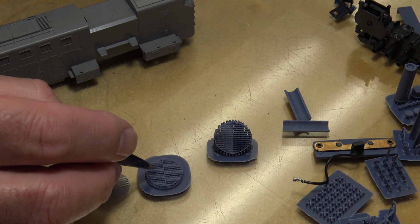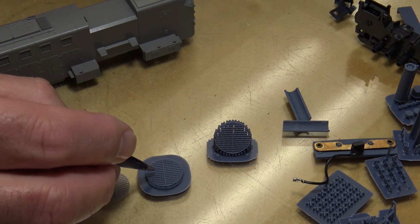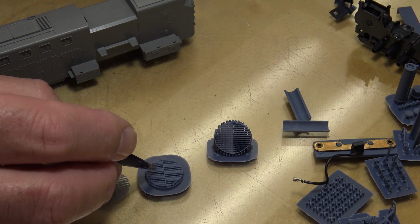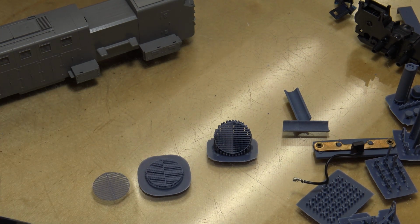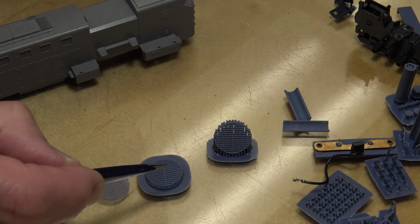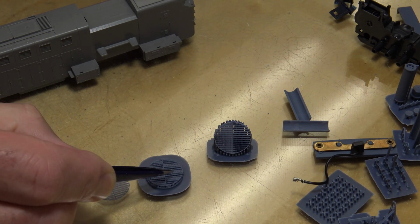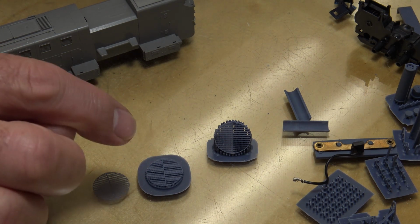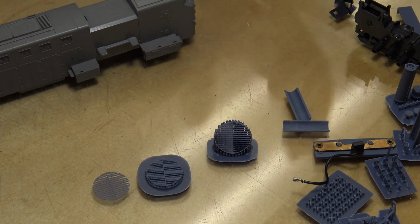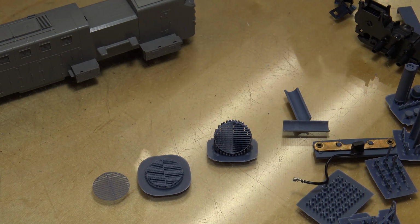The next test I'm going to do is to make these bars 7/1000. A thousandth can make a huge difference in how well they print. Although they printed well, they're still a little wavy in the perpendicular direction. But the thing about this resin is when it comes out of the cure station, it's still slightly soft, so it takes some time for that to harden up.